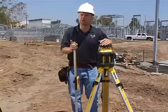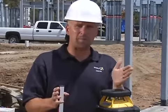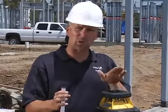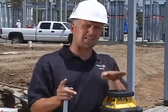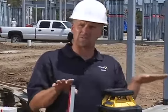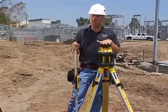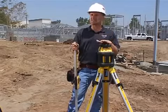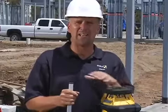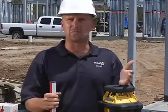Earlier at the commercial job site I showed you the LER-250 doing horizontal and vertical. It also does one more thing — it does slope. We call it simple slope: the laser will slope in one direction, down 5 degrees or up 5 degrees in that same direction. The simple part means it stays in that axis, and in the opposite axis the laser is always still going to level. Now outside on a job site, I want to show you an example of how simple slope works over a short distance.